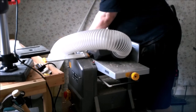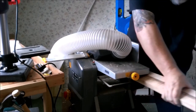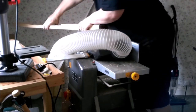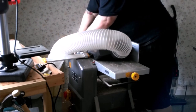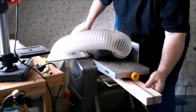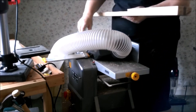I put it through and just take off half a millimeter at a time. The reason for this is I'm not in a hurry, and I'm keeping my blades nice and sharp by not asking them to take too much off at once. It also stops the wood from chipping out.